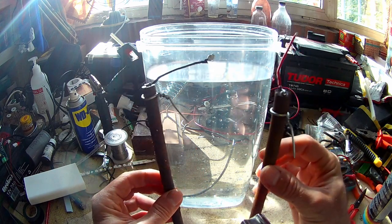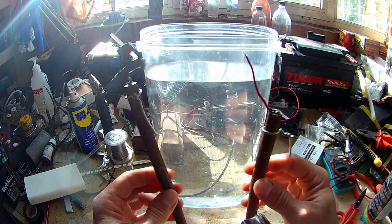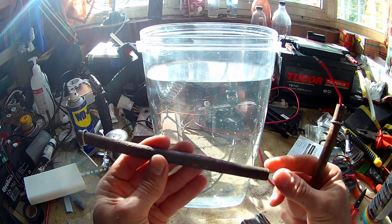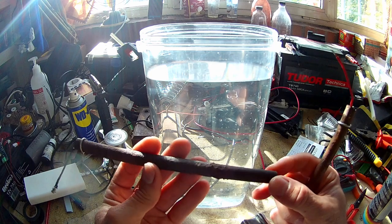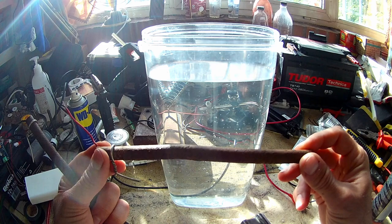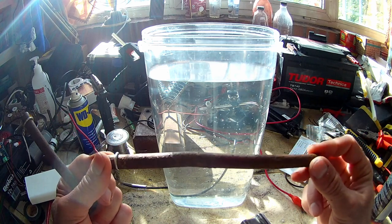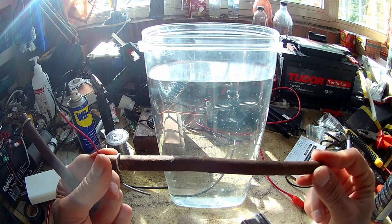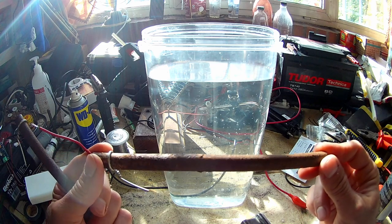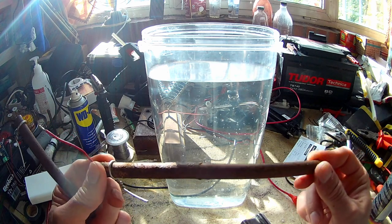When I took these two electrodes they were taken from the same bunch — they were equally rusty. Over time of use, it is normal that the cathode loses its rust while the anode is worse off than the starting point, because the anode is always sacrificial. Depending on the material you might have more resistant options, but any anode material is going to corrode with time.